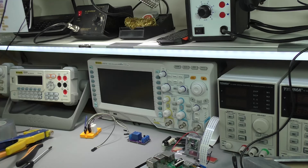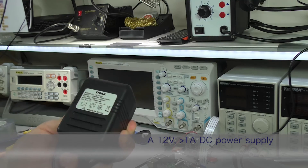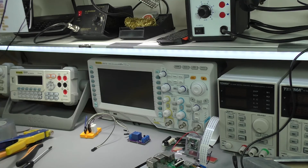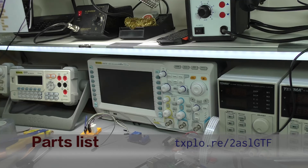Finally, you'll need an old power supply to drive those small power devices. This one I got from an old Dell screen — it gives me 12 volts DC which drives both the LED strip and my fan, and one amp is enough for this purpose. There are quite a few components I've discussed and it's probably too much to remember, so have a look at the link below — it'll take you to a list of components you can source. I'd expect that you already have quite a few of those things in your drawer. Let's move on to the next thing.